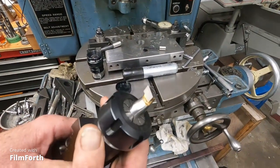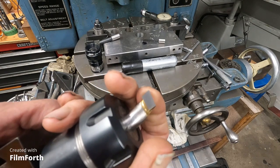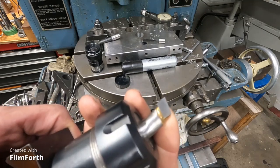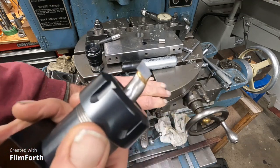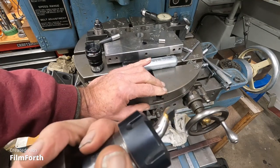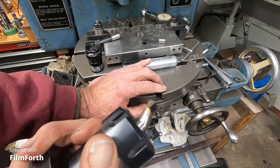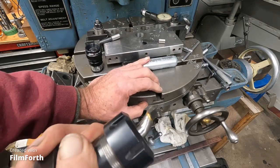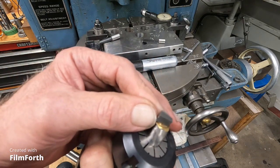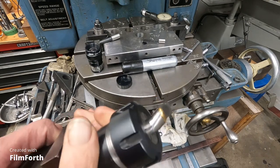What I'm going to do is go ahead and grind this back. I have a very tiny radius on there, between five thousandths and ten thousandths, and I do that by hand — it's just so tiny. I generally use a very shallow depth of cut. I was planning on a thousandth and a half depth of cut, and when it chattered it was three thousandths, and that happened because of the increased rake I have on the tool. This tool is special for finish work at minimum depths of cut.